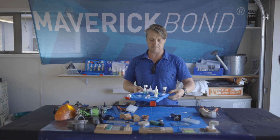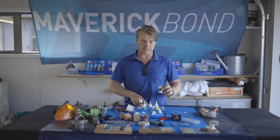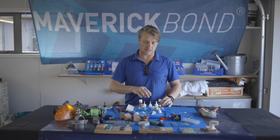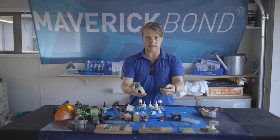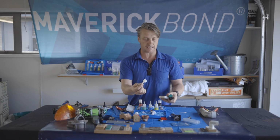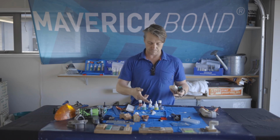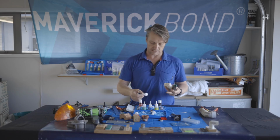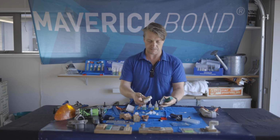Now the Pro Kit, what you have in there is the 4 that we've shown you, and then there's the primer. Now the primer's used a lot for plastic, so polyplastics are the problem. It's the oil in the plastic. So any hard coloured extrusion moulded plastic, the reason it's oily is because it goes through an extrusion mould. Pretty handy though, that's why our caps don't stick to the bottles. So we've got to treat the oil in the surface of the plastic first.